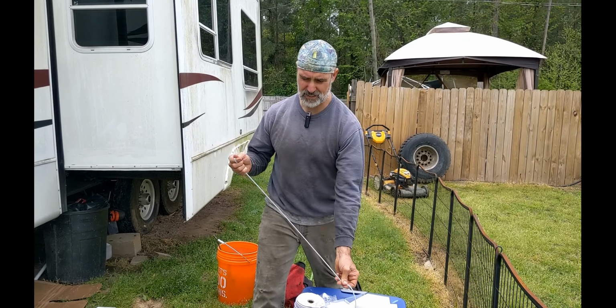A couple other things that are technically supplies, screws and fasteners. The way we're going to attach this to the frame is we're going to drill a hole and countersink it for the head. That screw is going to go up that way, right in the middle, where I've got my X, into the frame. So once that's in place, the way we secure the pipe to the standoff is by drilling these screws through there. These washers provide a more load-bearing surface.